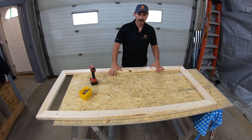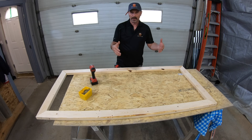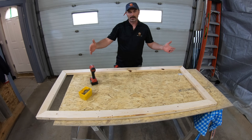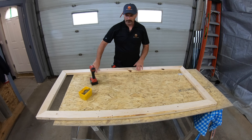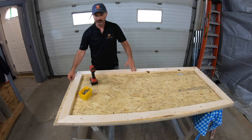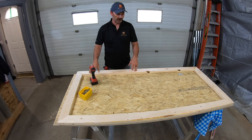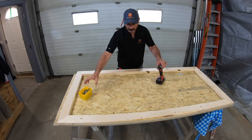My door is actual plywood siding so it's going to hang down and cover the edge of the floor. I've also left 2 inches at the bottom of the plywood so that this frame on the inside isn't interfering with closing the door.